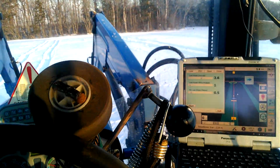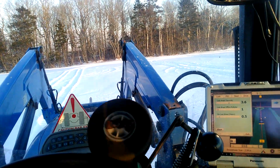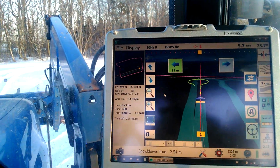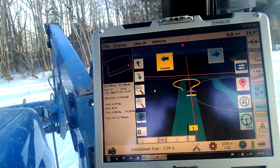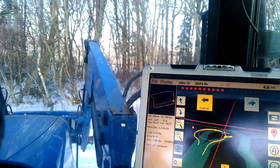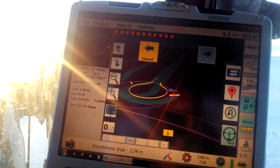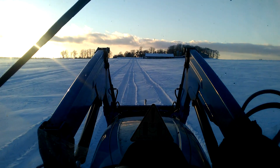What I've noticed is if you're doing a tight turn at the end of the field when you come into the U-turn, the look ahead point gets too far in the pattern. Let me show you what happens here — this would be a turn at a nice working speed. See how it wants to go outside the line, because the look ahead point is that far along on the pattern, the tractor tends to go wide and then it has to over-correct to get back onto the line.